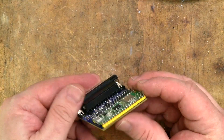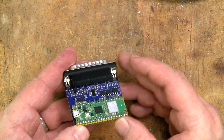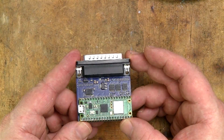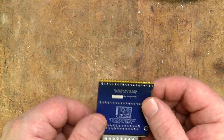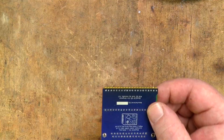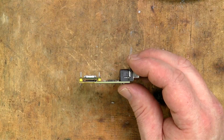I also don't like the way the Pico mounts on the PCB with headers, mounted above other components including the activity light. I mentioned I made a mistake while building my first Blue SCSI external, so I was keen to check all my soldering, but once the Pico is mounted I can't check any components under it. I think surface mounting the Pico on the underside of the board, like the Zulu SCSI, is a better solution — it allows for a flush mount, doesn't obscure any other components, makes the whole thing about a millimetre thinner, removes the need for these annoying headers, and reduces the amount of soldering to build the kit.